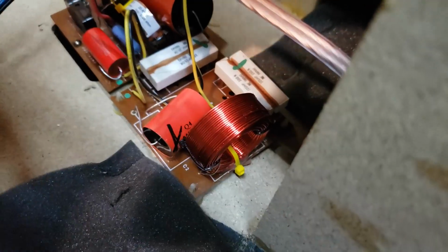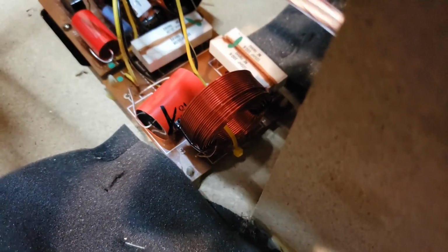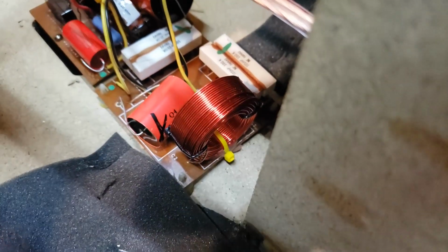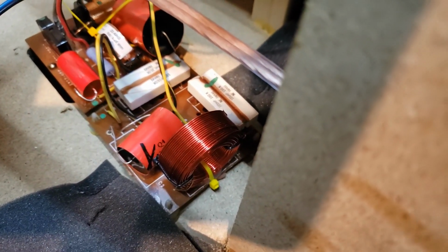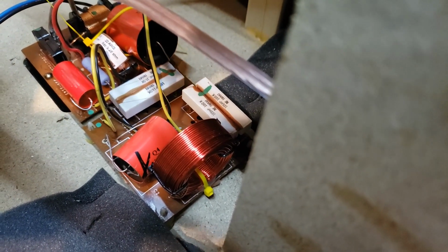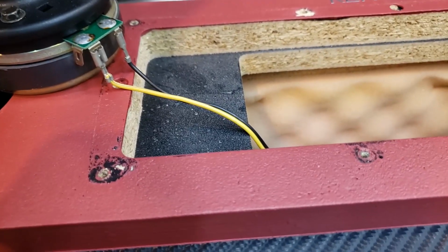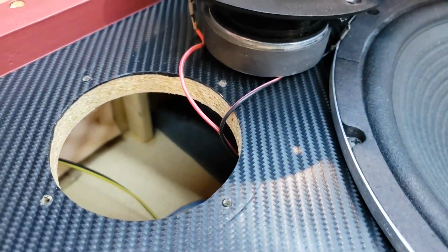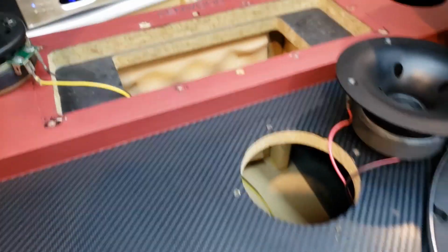And I did think about upgrading the wire, but the actual pin hole that goes through the PCB board, where you'd feed the wire through to solder it, is really small. So going up to a 16 or 14 gauge wire just wasn't possible without maybe drilling the hole larger in the PCB board, and I just didn't want to mess with the PCB board. So I just left all the original wiring, which is not bad. It's decent size, and it's copper wiring, so not bad.